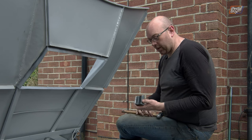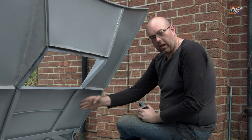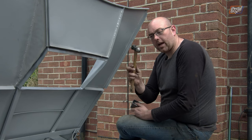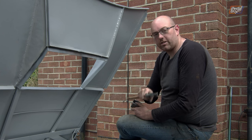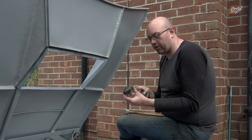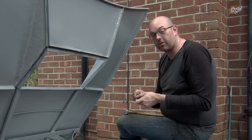To do all of this I've basically used a couple of different wedges. I have another one inside which is a comma shape that I could actually fit underneath this framework and gave me a nice flat in one direction but curved in another direction surface, that I could hammer off on the other side to get it nice and flat. The hammer I used is half a round round-over and half a square round-over nose. There is also a flat nose one and a pick one, but I didn't use those for this. And a couple of dollies — one is a perfectly flat dolly, or was once upon a time, with a slight curve which is very good when you have a compound area. The other one has two different radii and a nice sharp edge for when you need to get up against things.